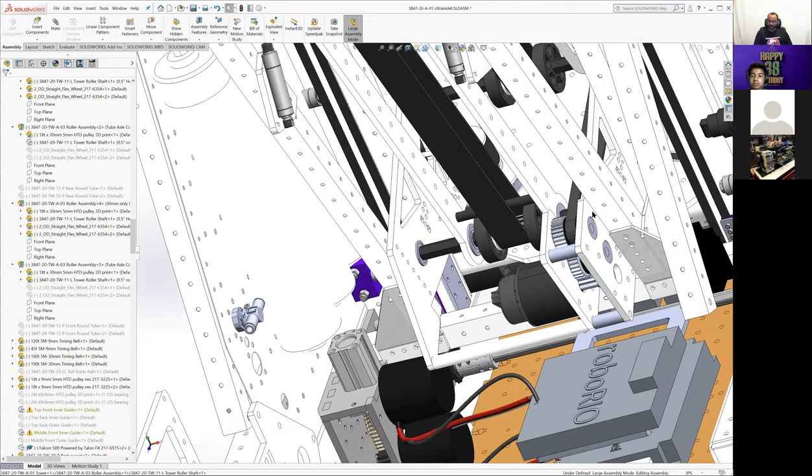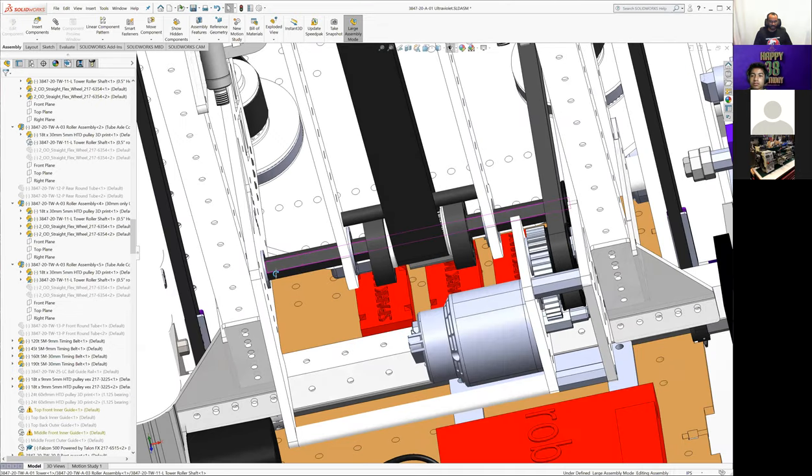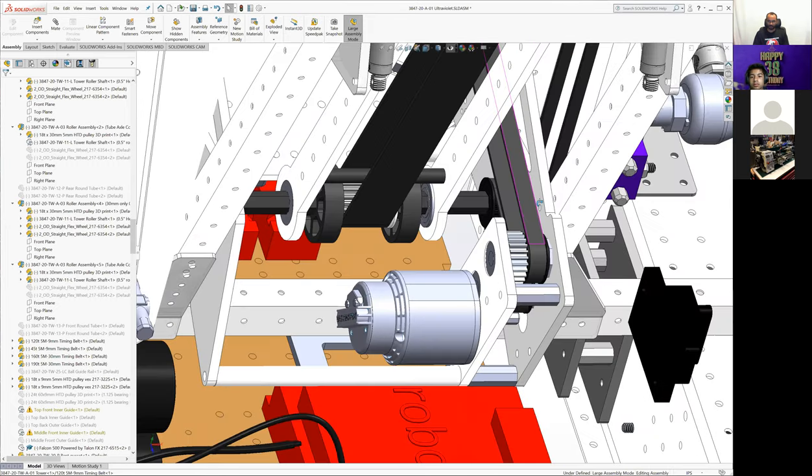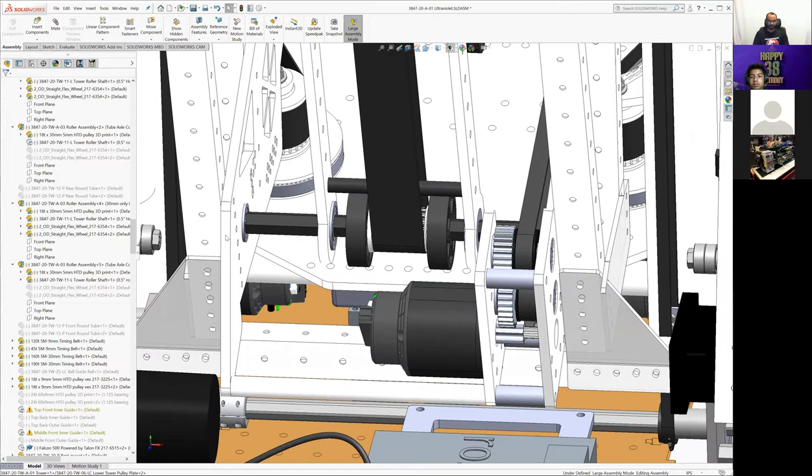There was some weirdness on this in terms of spacing, because we didn't have, what did we not do? One of the things we do during our prototypes that's kind of frustrating, that we don't have a really solid fix for, is that our materials change thickness slightly. All these things that we categorize as quarter inch material, whether that's in some places 5 millimeter plywood, 6 millimeter plywood, 6 millimeter polycarb, quarter inch polycarb, and quarter inch Delrin, all get grouped together as this quarter inch material. But they're all slightly different, and that definitely affects some of our shaft spacings and things. So if we're not being careful, things get a little wonky.